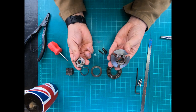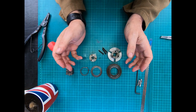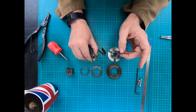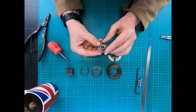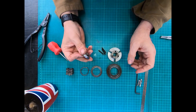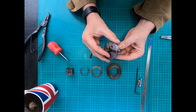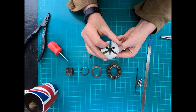That's basically it in pieces — looks incredibly easy because I've already done it. These screws are the biggest challenge getting out, but if you don't need to remove the back plate, there's no value in doing so. I need to for the screw-cutting attachment. The way I did it: I just loosened the screws so they were slightly protruding, then gave them a tap.